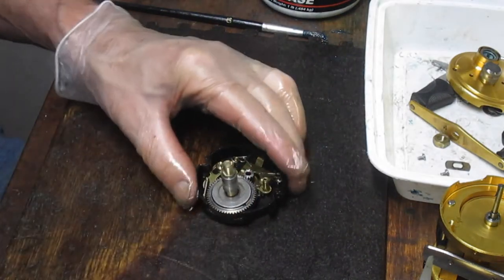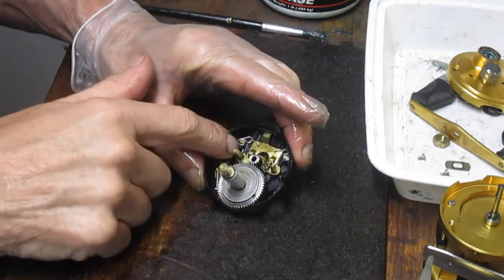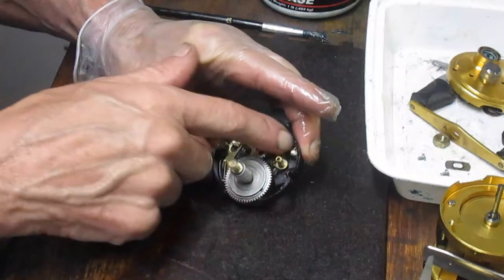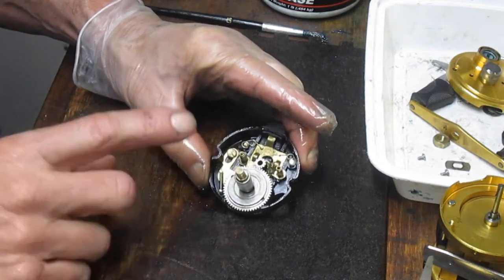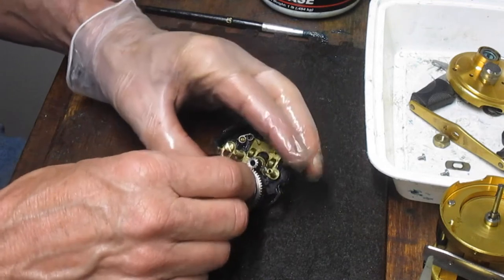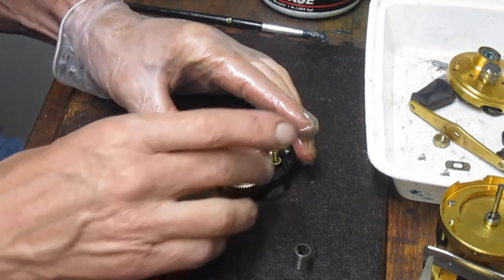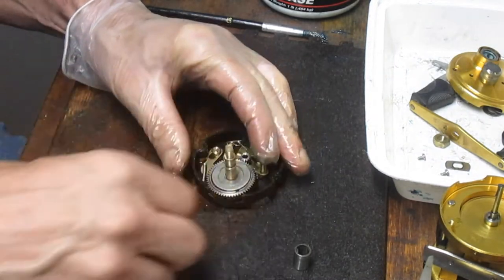We're going to grab the collar. This is a good time to tell you — if you don't know this reel, take pictures. Because if something goes shooting in here, like the little springs on your free spool release, if you take the pictures now you notice the orientation of them, where they hook in, what posts they wrap around, and so on. It's better to do that now than pull an assembly out and forget where things go. I've been getting a lot of reels in bags lately — folks get started, get ambitious, and then realize they don't recall where things came from.